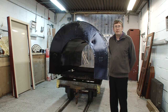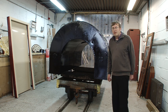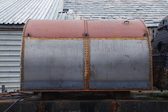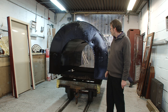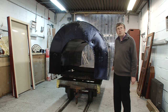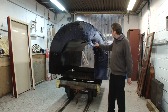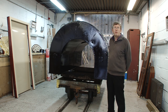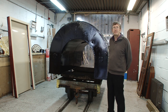This is Welsh Pony's tank. As you can see the restoration of this is now pretty much complete. We had to renew various lower parts — the plate work down the sides inside and out has been renewed because that was rotted away, but most of the top of the tank is original and tidied up. The new pieces have been riveted in the bottom, similar to the original construction. And we were able to save this brass pipe here which runs right the way through the tank — that carries the blower pipe for the loco within it. The brass pipe was not too bad; it had new ends put on it and it's gone back in again.